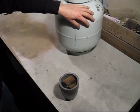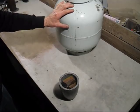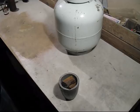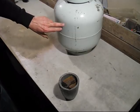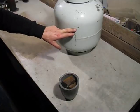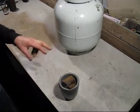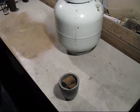When the liquid propane gets colder and colder you'll notice with your furnace that the flame will disappear down the exhaust vent, and you'll have to keep turning up the regulator to compensate. You'll also be able to see the level of the propane — this part from down here to here will be all frosted up. And when that happens it can be very annoying and you can't concentrate on actually working on the furnace when you are melting cast iron.